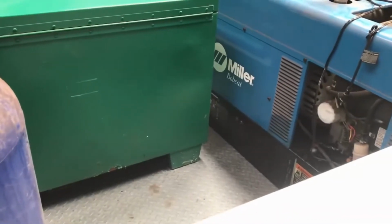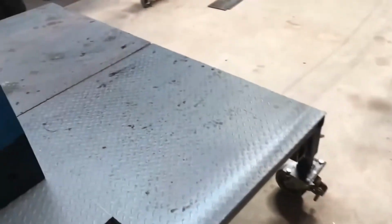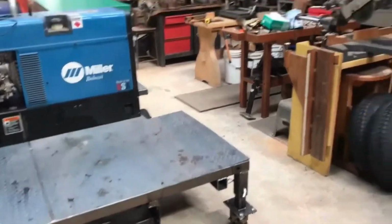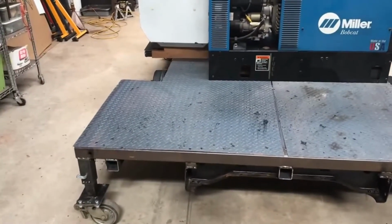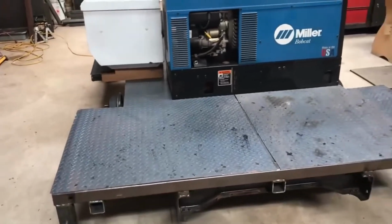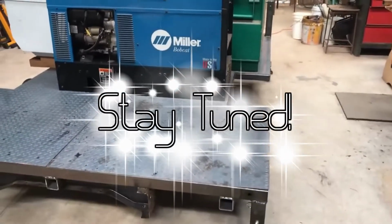But this cavity in between here is where I'm going to put the oxygen acetylene bottles and whatever else I need to. I may, of course, scoot the air compressor back and end up with some sort of a cabinet there. I was just trying to figure this out. Thought I'd just throw this stuff up here and see what I thought before I get started on the workbench. And as far as the height, I measured all these other workbenches I've got, and they're somewhere in the 33 to 34 inch range. I'm thinking about going on up to 36, and that'll give me some pretty nice room in between that and this decking to put drawers and other storage. But anyway, there's a dry fit of how the equipment possibly might lay out. You can see that corner post down there. And there you have it.